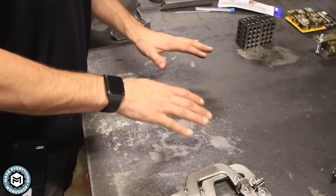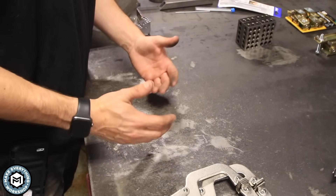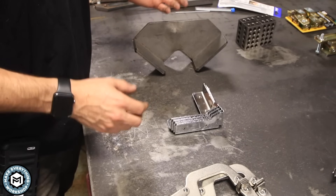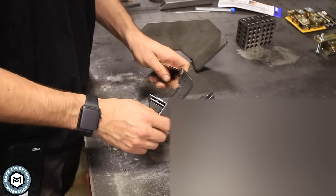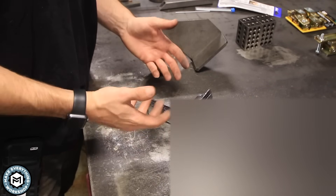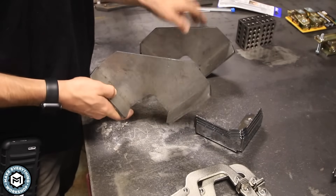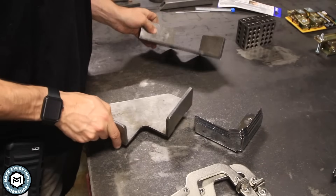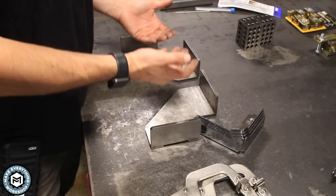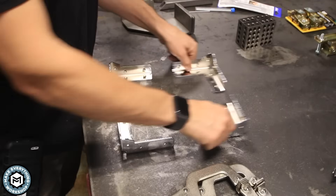When you're welding on a flat surface without fixturing holes, getting corners square can be really difficult — it's not like woodworking where when you clamp something square it stays square. Corner jigs can be really helpful for that. These are inexpensive corner jigs I bought on Amazon just to see what they were about — eighth-inch material, bent on a press brake, with some holes in them. They're not super impressive but they'll get the job done. My favorite corner jigs are these from my friend Brandon at Ollie Iron — $50 for the pair, made from cold-rolled laser-cut quarter-inch plate. They're thin enough to get a clamp on them and they're all quarter-inch so you can raise things up off the table if it isn't perfectly flat.